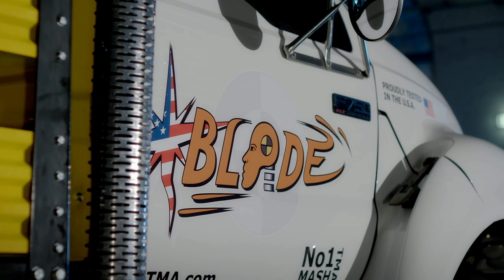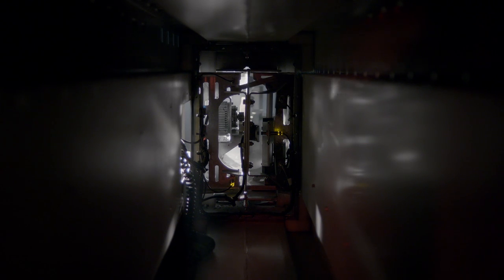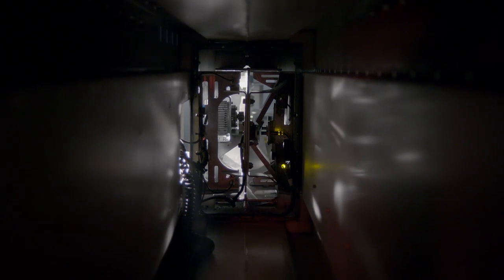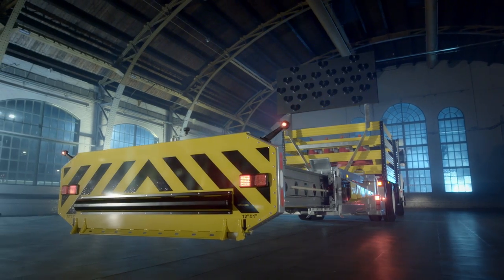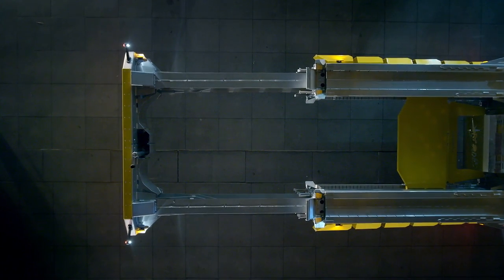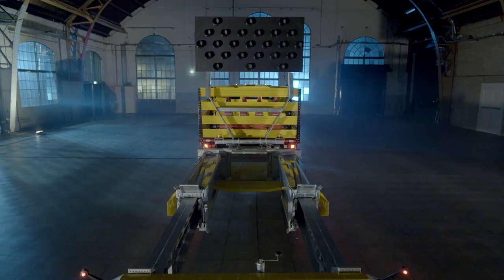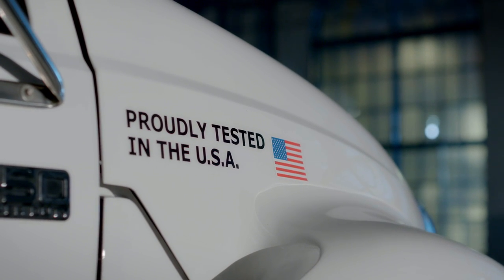Let's show how this patented invention works. The TMA has 12 internal blades. The first four blades cut through the aluminum H-beams, and after unlocking, eight blades cut through the tubes. The strength comes out of the profiles, and the remaining weak aluminum parts will bend away in safe directions during impact. This is a really unique combined way of absorbing energy — it has never been done before.